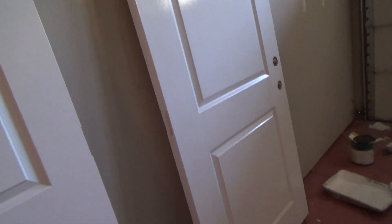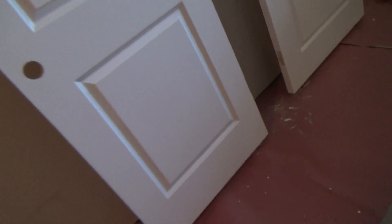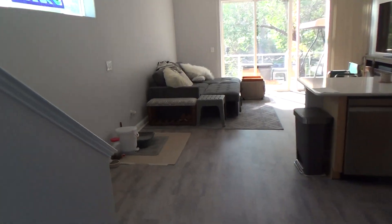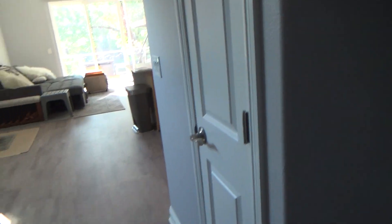I'm going to let this dry now — I think it turned out really good, really nice. Once it dries I'll sand it down, put another coat on, let it dry for 48 hours, and I'll show you what it looks like. It's kind of hard to imagine I painted this whole thing with a quarter-inch nap six-inch mini roller, just like I painted all the interior doors. They look pretty much like a professional painter did them.